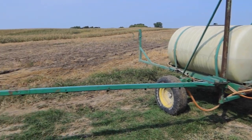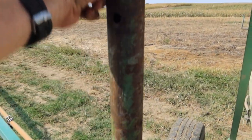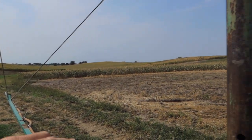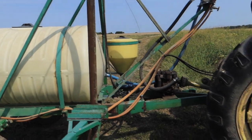This is my high-pressure single-sided boom sprayer that I use for pumpkins and sweet corn. What makes it unique is that it only has a boom on one side with manual adjustments — it slides up and down on this tube. You can see these holes here for setting the pin to hold the boom up at different levels. When spraying sweet corn I want that boom six to seven feet high, spraying down on the silks. Today we're a lot lower — probably two and a half feet off the ground for spraying pumpkins. That's a 300 gallon tank. I'm normally spraying five to ten acres at a time. At 175 psi you can really penetrate the crop canopy, getting fungicide, insecticide, and foliar fertilizers down into the canopy. It'll swirl around under the plant and get underneath the leaves up into the stomata where those foliar nutrients can be absorbed.